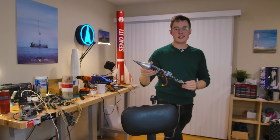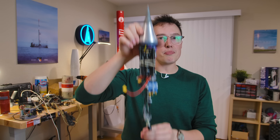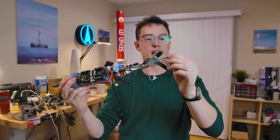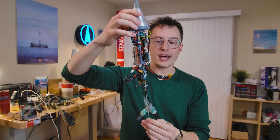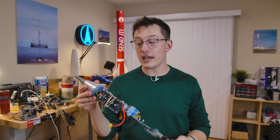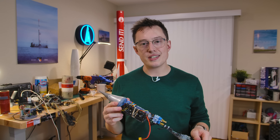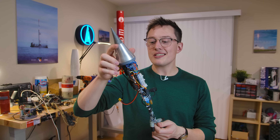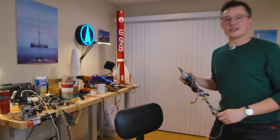Something else I wanted to mention is what I call the Smokey Joe. The Smokey Joe is a little assembly that sits right below the nose cone — it actually is the nose cone of the rocket, and it screws in on a 3.5mm threaded rod. There's an AVA computer, a ton of thermocouples and thermocouple amps, telemetry radio, and GPS antennas. It's basically a full avionics stack mounted on a rod. I'm not going to give too much away about what this is, but it shouldn't be that hard to figure it out. Unfortunately it died on the launch pad, so we don't have any good data from it — it's going to have to get flown again before it becomes useful at all.